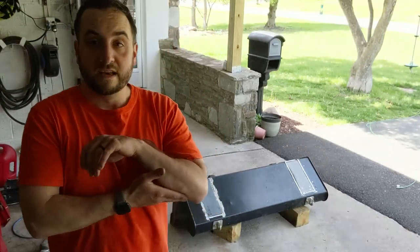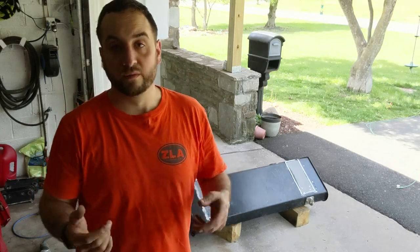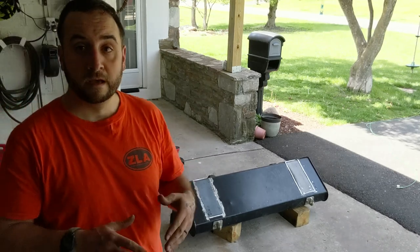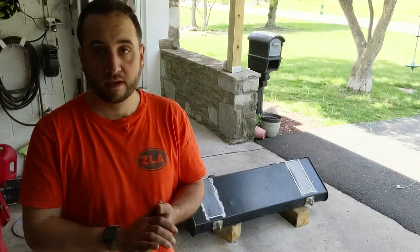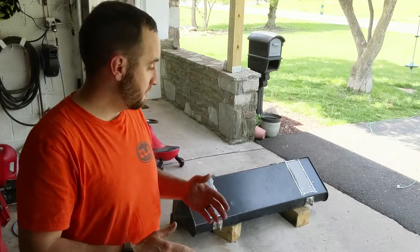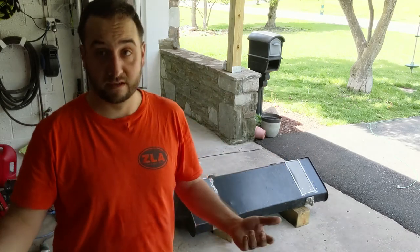All right, so as you can see, I got done with all the ears, taking them off. I did two methods of doing it for you to look at, which was basically on the closer side to me, I ground the welds. Pretty laborious, pretty crappy way to do it, but it does lower the amount of grinding you have to do later. So it's really six in one hand, half a dozen in the other.